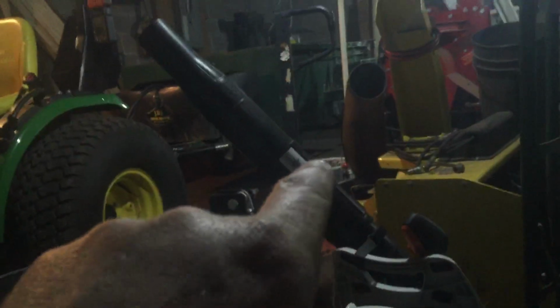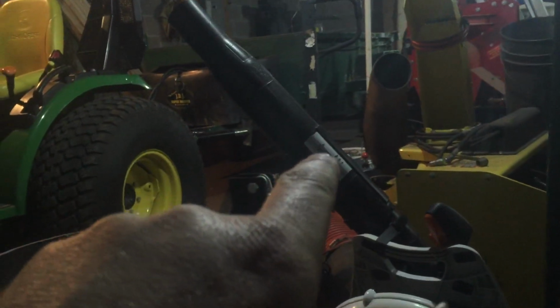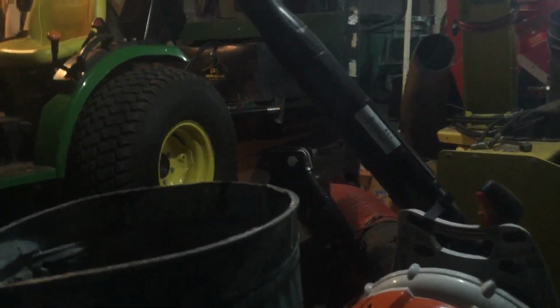He mentioned something about, well, I had this big trailer full of dirt. Remember I showed you that yesterday, and I was showing him that, and he's like, whoa, there's a major problem here. I'm like, really? Why? He's like, at the very back of this trailer where that mount is, he says they've welded that on the wrong spot. I'm like, what? That's a factory built trailer. He's like, oh yeah, it should have been way back here, where this one's up here, so it's bending it, totally the wrong way. I'm like, oh, well, that's not much good.